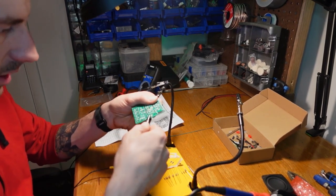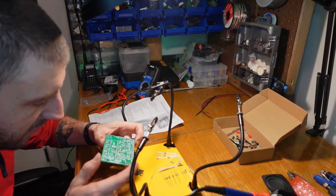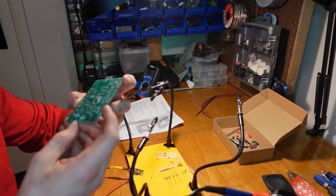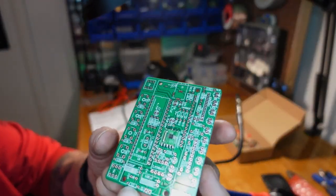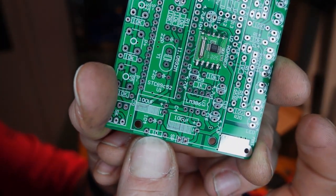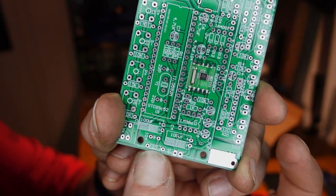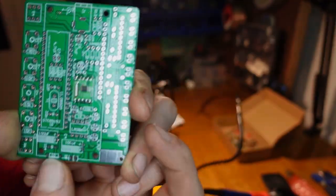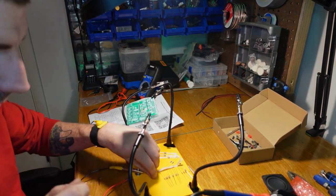Let's try to find R6 here. Come on, Dane. You can find it. Oh, I found it. It's way down here. Okay. See, the R6 spot is not labeled as R6, but it does have the resistor illustration there, and it says 10. It doesn't say 10K or anything like that. Just 10. Therefore, that has to be a 10 ohm resistance position. And if it's not, well, then I don't know what to tell you, but that's what I'm going with.